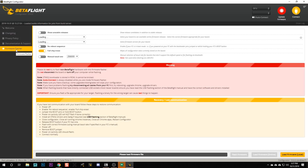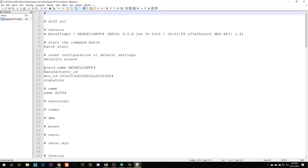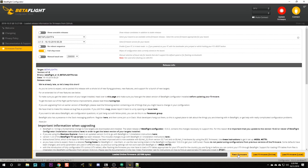Flashing is done from the firmware flasher page. Before I can flash, I need to know what target to use. Each flight controller has its own target and if you flash the wrong target, your flight controller won't work correctly. The answer for which target to select is in the config dump you saved previously. Look at the line that says 'version' - after that you'll see the target name, for example 'BETAFLIGHTF4'. Find that target in the list, select your Betaflight version - 4.1.0 - hit 'Load Firmware' and then 'Flash Firmware'.